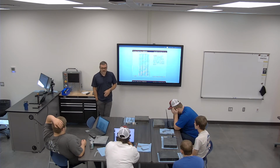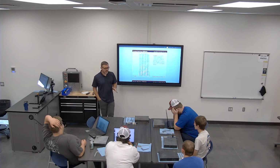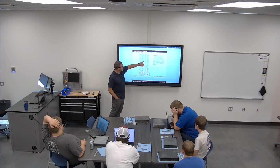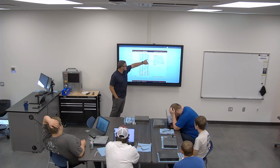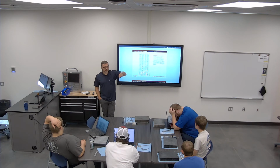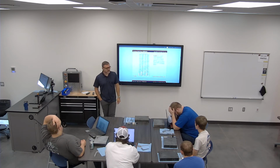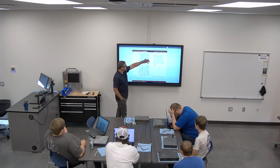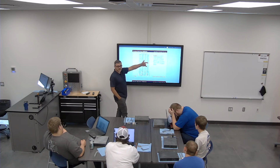There's not much rounding. Generally what I'm going to ask you to do as 101s is to hold things out to three-place decimals. That's the 1/1000th of an inch. I have key cards on our toolbox. Let's look at 5/8 of an inch, 625, but then let's look at 19/32. That's 593 thousandths and 7/10, but it could be rounded up to 594. That's really about as much as I would want to do on that one. 9/16, you could go 562.5 or 563 would be appropriate for that.